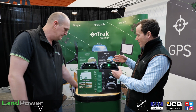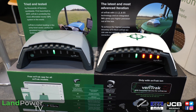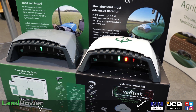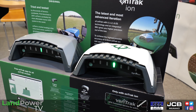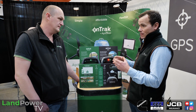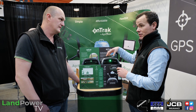So with the new one, we have basically upgraded the GPS receiver that's built inside. It now has a multi-band receiver so it can receive L1, L2 and E5 bands, which basically just makes the signal a bit more stable. So straight out of the box, this one is going to deliver a higher level of accuracy.